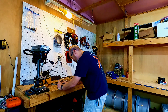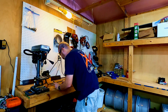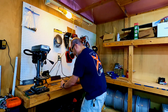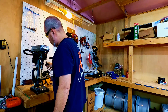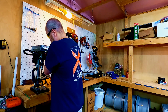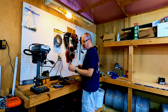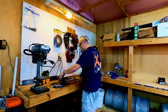Got my punch and my hammer - we're going to hit this. Perfect. Do the same to the next hole. Good enough. Once I drilled through, there were some shavings on the outside where the drill bit went through, so we're going to shave those off with the Dremel and smooth it out.